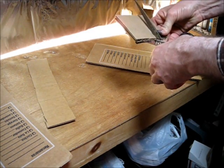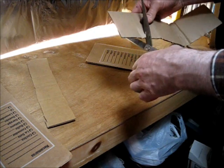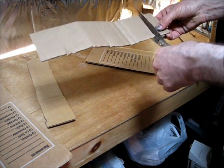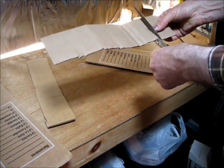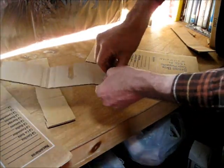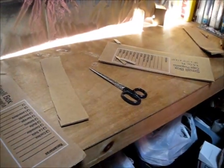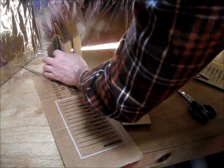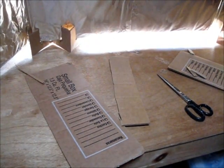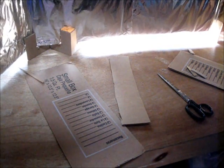And right down the center, basically, you make a cut. Open it up and finish that cut down to just an inch from the bottom. You just want to have an airflow on the bottom of this to allow cold air to enter your window heater. And then simply peel that down, rip it off, peel it down, rip it off. Now you fold it. And simply lift this up and put this underneath your heater. Now I'm going to make a third one, and this will stand up nicely now, and I should start getting heat when the sun shines.